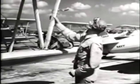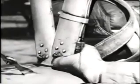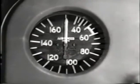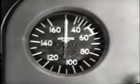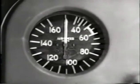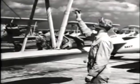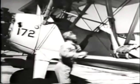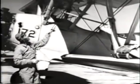Moving on around to the leading edge, you next inspect the forward strut and the fitting bolt at its base. That little gadget attached to the strut is called the pitot tube. It's connected with the airspeed indicator in the cockpit. The airspeed indicator is the equivalent of the speedometer on an automobile, but it won't work if the pitot tube is covered or stopped up, so you check the tube. Test wires for tautness, but don't pull them too hard or you may damage the spreader, which serves merely to hold the wires in position and keep them from vibrating. At the same time, be sure the spreader is secure.